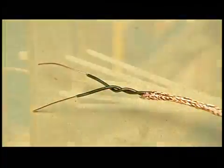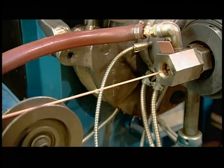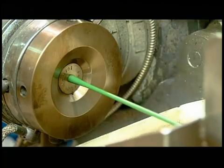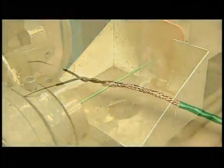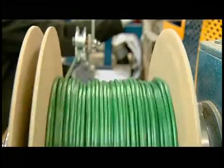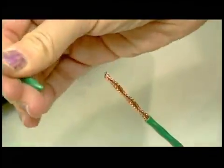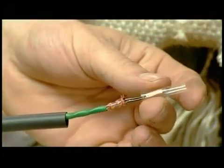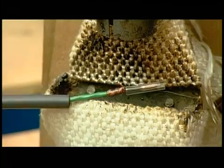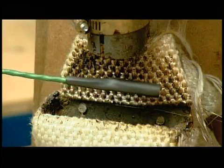The cable's internal wiring is complete. Now they run it through an alignment jig, which straightens and smooths everything out in preparation for the next extrusion process, which coats the wiring in a final plastic jacket. Then they wind up the cable on a spool to prepare it for packaging, and put one end into a machine that cuts off a few centimeters of jacket. After soldering the two conductors to each other so that the electrical current goes out on one and returns on the other, they insulate this connection from the braided ground with transparent heat shrink plastic. Then they pull the ground over the now insulated end and cover it with a black heat shrink plastic. This seals the end of the cable so that water can't seep in and short out the wiring.